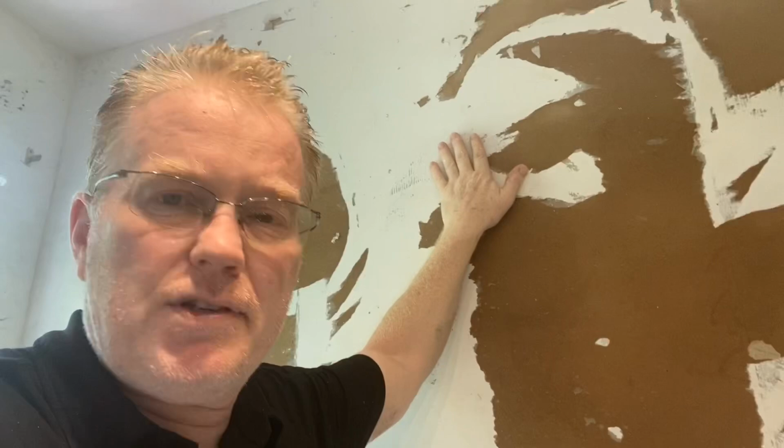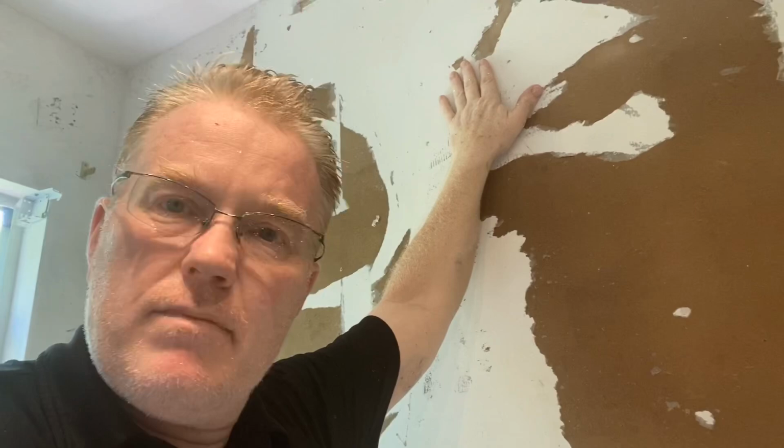Raw sheetrock is always sealed. Spencer did not say that you seal walls before you prime them. No, I didn't say that. I said you seal raw sheetrock before you prime them, and then paint them or wallpaper them. Raw sheetrock must be sealed because the paper needs to get tied down, and the way you tie it down is to penetrate it and glue it to the gypsum.